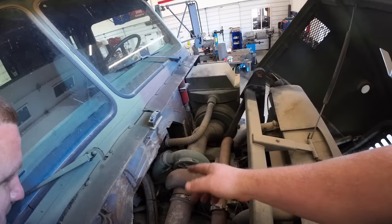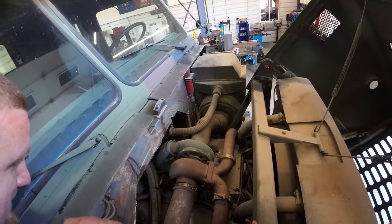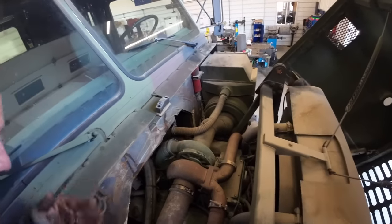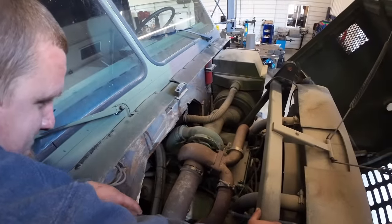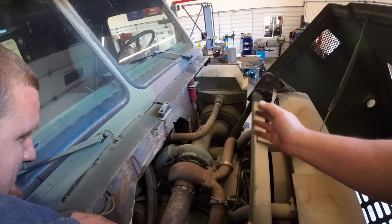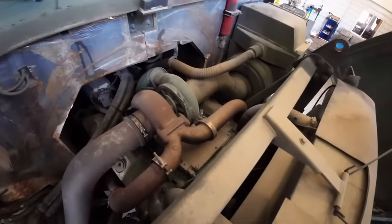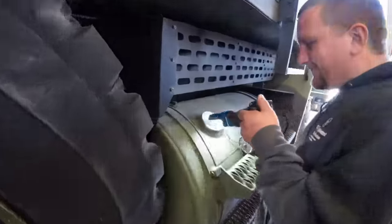You see the numbers on your hot rods? So that's an 871 blower. You know, you see a 671? A 20 millimeter turbo going into an 871 blower. So that's where your blowers originated from, was from these Detroits. So this is an 892. The 92 stands for 92 cubic inches per cylinder, and there's 8 of them. See, I always like diesels for this very reason. It's very simple. That's how you make all the power.